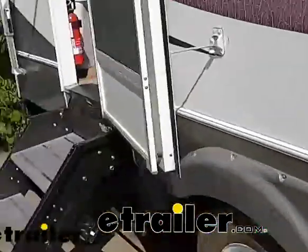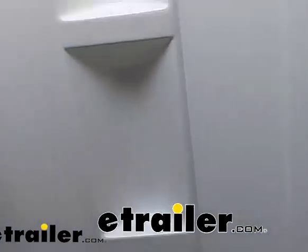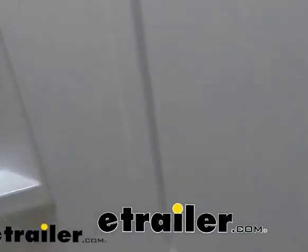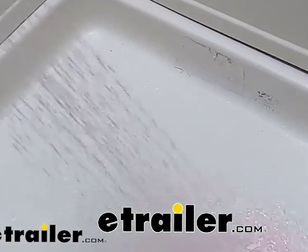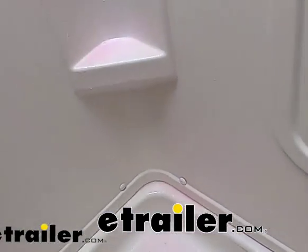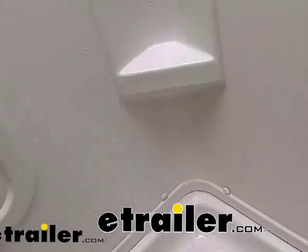Now we can go inside and do the shower, which is the furthest appliance away from the pump itself. So we can turn that on. Be sure not to spray it on yourself. So we got it on. Wait for it to turn pink. See there, it's pink. So we'll shut it off. Turn the hot water on. That's showing pink. Turn it off.